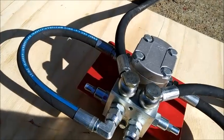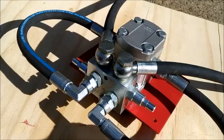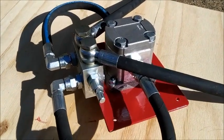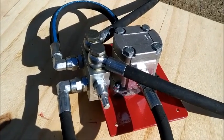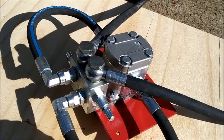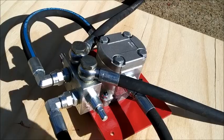The second relief valve I have modified to act as a one-way valve so that when the hydraulic pressure is suddenly stopped and the motor tries to spin, the hydraulic fluid can still rotate through the pump from the outlet back into the inlet until it stops.